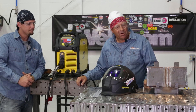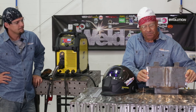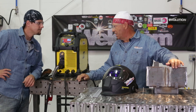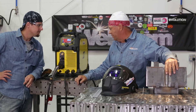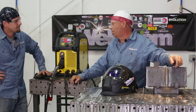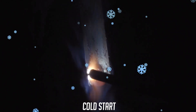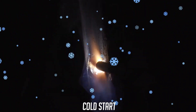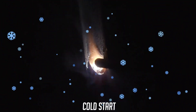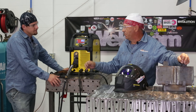On our arc force demo, we ran off the same plate — we used arc force and got a substantial root in, and we've saved this plate so that we can run fill passes. I want to show you what this hot start will do when we're running 7018. What's the biggest problem we run into when running 7018 fills and caps? When you're striking an arc, you get kind of a cold start and leave a little porosity. I've done it, I don't know who hasn't. We do subtle techniques to get rid of it — we long arc for just a second, let the rod heat up, get going, put it down, try to blend in, and weld through that.